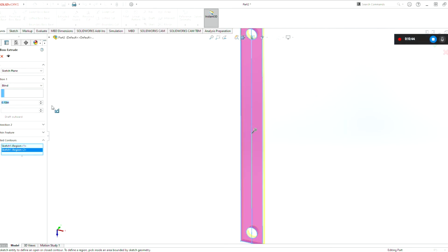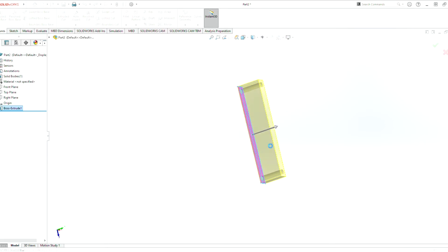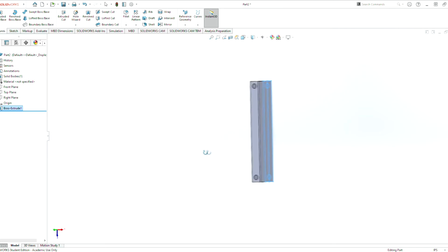And for this piece here, for the height of the gearboxes, we had to take into account the thickness of the gears and the thickness of the bearing. So the gears are typically half an inch each. So a half an inch plus a half an inch for a two-stage gearbox. That's an inch by itself. And then we want to add a little bit of wiggle room for the bearing. So let's add a quarter of an inch, so we'll be making this part 1.25. And that's this part here. This is our spacer here. So because this part is now done, we can save this part off.